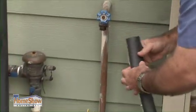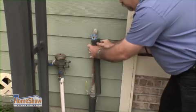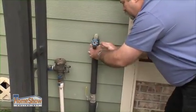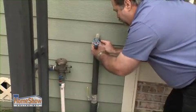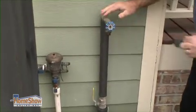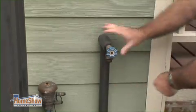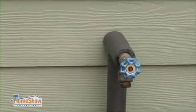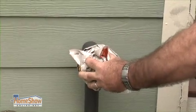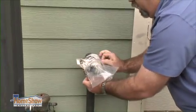We've got exposed pipe here. We want to use an insulation. This one here comes with a piece of plastic tape on it. You peel it off. You cut it to the length that you're needing. You peel the plastic off the tape. You tape it up. Do the same thing at the top up here. Get your piece of insulation on there. Got it set up. And of course, we talked about, if we've only got newspaper, let's wrap the newspaper. Maybe put a plastic bag over it if we can get a plastic bag over. If not, we'll use some duct tape.